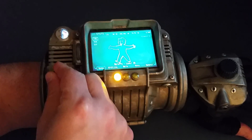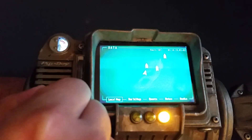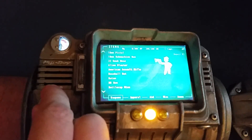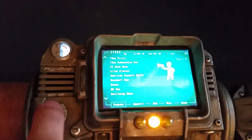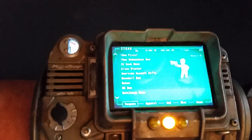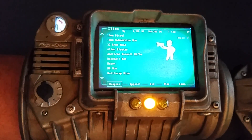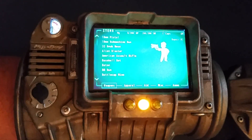As you can see, as you turn the knob, the screen switches as does the LED under the screen. I added another white LED behind the rad meter to illuminate that, and that LED is also powered by one of the optional active pins on the Pi. There is an option in the configuration menu where you can turn that pin on or off.